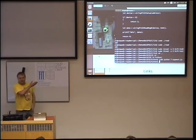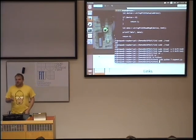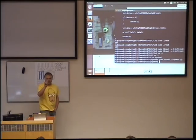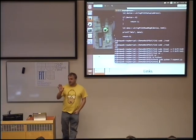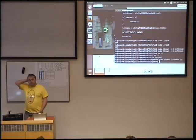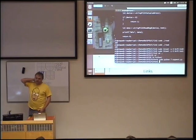You program in BASIC. You don't need any special hardware programmer. You need just serial cable and 2 resistors. That's all. Everything is available for Linux, macOS, and Windows, for all operating systems.